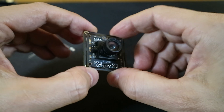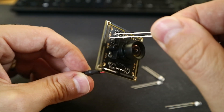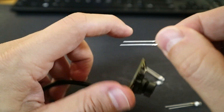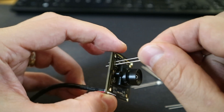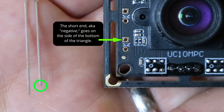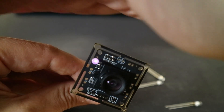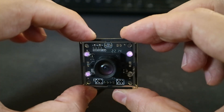Now we're ready to start mounting the LEDs. If you want, you can first just test the LED to make sure you inserted it the correct way and that the camera is powering the LED. I'm just going to push it through temporarily so you can see what it looks like. The long side, also known as the anode or positive lead, should go in the hole closest to the small line. The short or negative side should go at the bottom of the triangle. When the Spinel camera is on, you should see the LED turn purple when viewing it through an external camera, even if it's just resting in the holes.